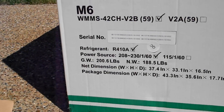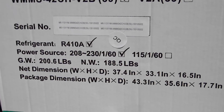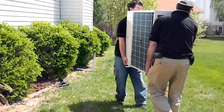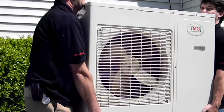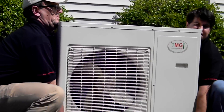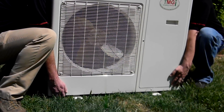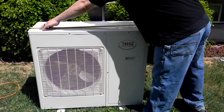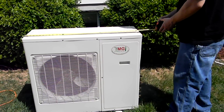Check the unit weight, which is listed on the box, to help aid in lifting safely. With everything in good order, you can proceed with the installation. Find a location not in direct sunlight or where there are high headwinds. Allow enough clearance behind and to the sides of the unit for maximum airflow through the coil.